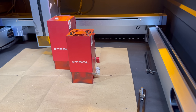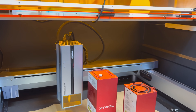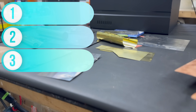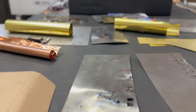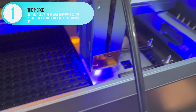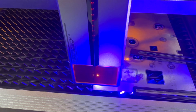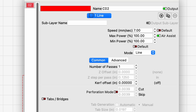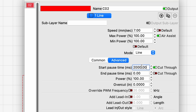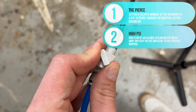With all my testing over the years with the 20-watt, 40-watt, and now the 70-watt, I've found three things essential to success when cutting metals. Secret number one: the pierce. Setting a delay at the beginning of a cut allows the laser to pierce through the material, letting heat flow through rather than building up and causing warping. This can be set up in LightBurn under the advanced tab — I set mine with a 2000-millisecond, or two-second, delay at 100% power.